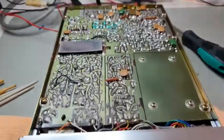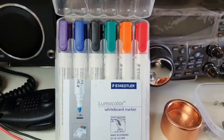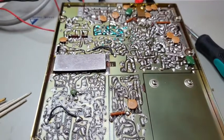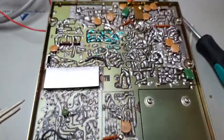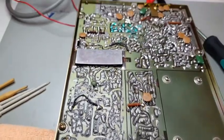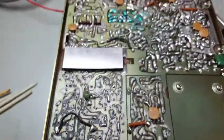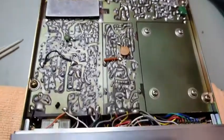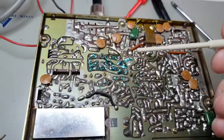An addendum to the last video — just a neat trick I found a while ago. Whiteboard markers — I've got a pack of them and I use them on all the circuit boards. What it does is help me work on areas that either need to be worked on, or areas that are finished. For a cap change I use orange or red, and for dry joint work I can go over a whole radio and mark on top of the solder where I've isolated the dry joint.